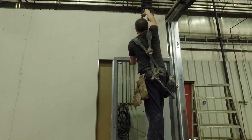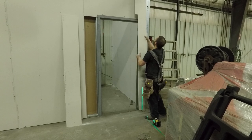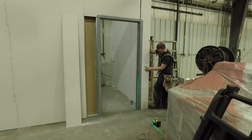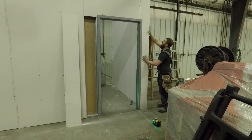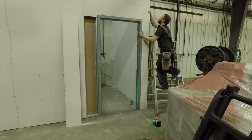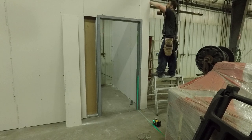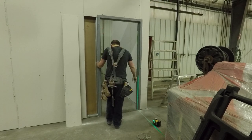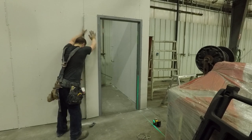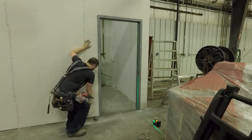Just to give you guys an idea of how to be ready with your screws. There's the bottom spacer there as well — always using that spacer. Kicking that in, it should all fit in nice. If you've got standard doors and you're having any issues, 45 all the pieces in the back — the sides that are going into the door frame. The drywall has to go inside the frame to be fire rated, that is part of the code. These rooms are going to be airtight and fireproof. This is in a painting and sandblasting shop, so the fire code is pretty crazy — they wanted it air sealed.